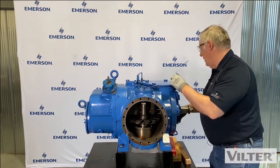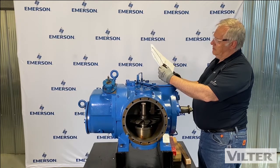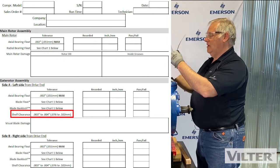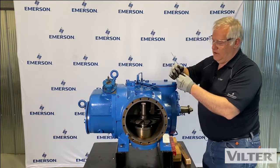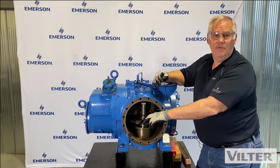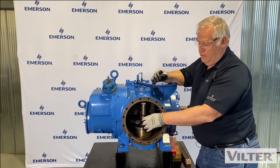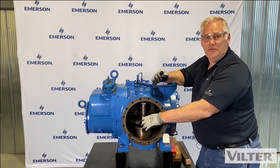What does my chart say? I want for shelf clearance — it says three to four thousandths of an inch. So we're right on. I'll show you when we take the main gate rotor out how that is adjusted. Because on a machine, that is adjusted when it's new. You may have to adjust that if you put new blades in. A blade kit will give you new shims.